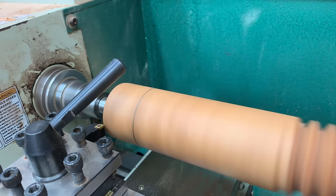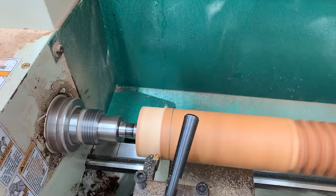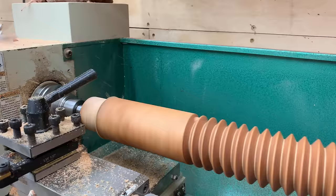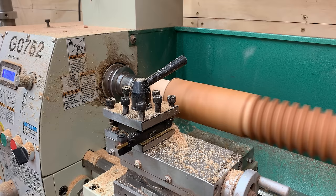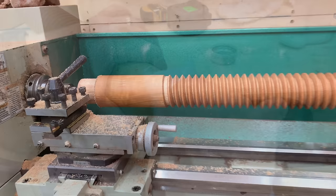I've got to use the metal lathe here because Maya is using the wood lathe — she hogs the wood lathe all day long. What I did was drill a two-inch hole inside of the head for this bolt, so I just have to cut this down to exactly two inches in diameter so it will fit nicely. One thing we've found from working with wood: typically you want to be five to ten thousandths of an inch under the size that you actually need in order to get a nice fit with glue. So for a two-inch hole, we made this one ten-thousandths of an inch under — one one-hundredth of an inch under — and then with some glue it fit really well. We got a piston fit with the glue, so it took us a second to actually get it on.